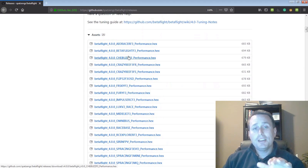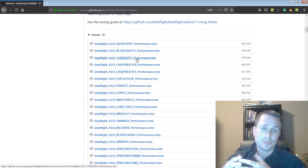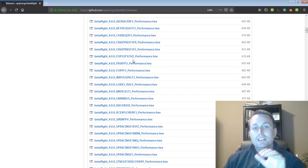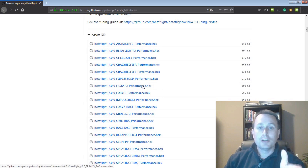When you're looking through the list and your hex file isn't there, that means that F3 board's official release actually has all the flight performance content in it — it had enough flash space. The biggest, most difficult ones are the Betaflight F3, the Omnibus — which are very popular boards — and some SP Racing targets. If you're in Betaflight and you notice that you turn something on like D_MIN or other features, save, come back in, and they're turned off again, that means the feature is not in your official release for your F3 target. If you see your target in the list, go ahead and download that hex file.